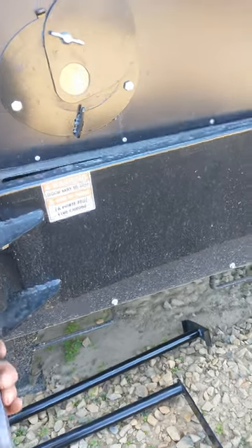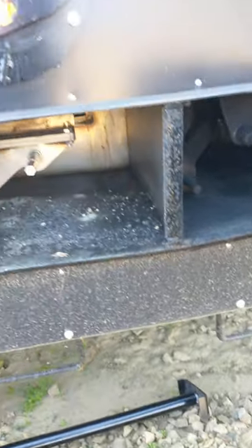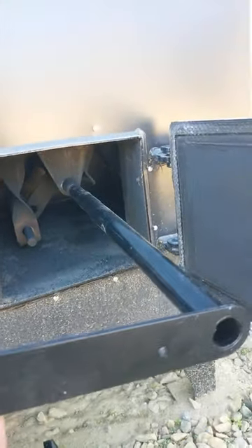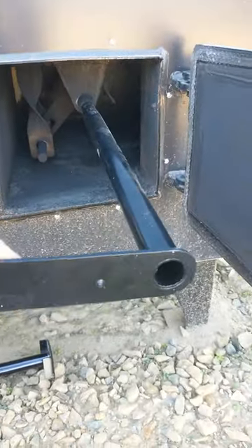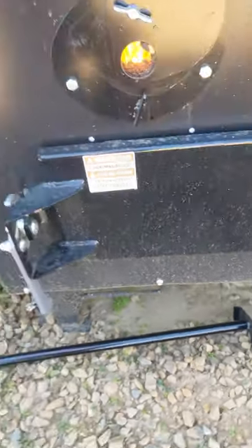So if I break the suction here, there's the grate. There's a tool here that shakes the grate, and then there's another spot over here where the same tool shakes the spirals — rake the spirals up and down. There's also another access port on the back where you shake another set of spirals to clean the exhaust tubes. The ash falls in the bottom.